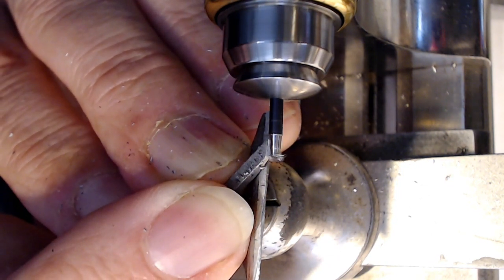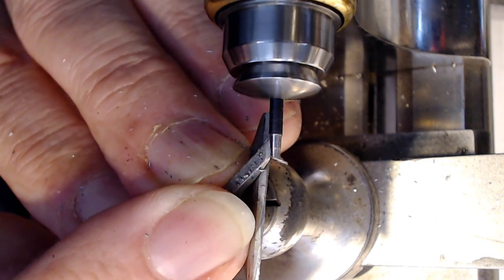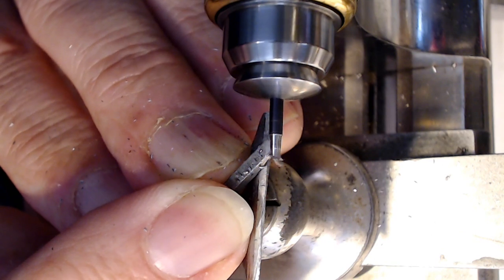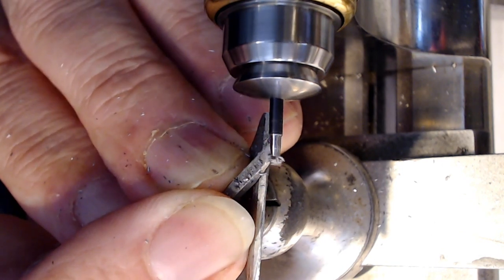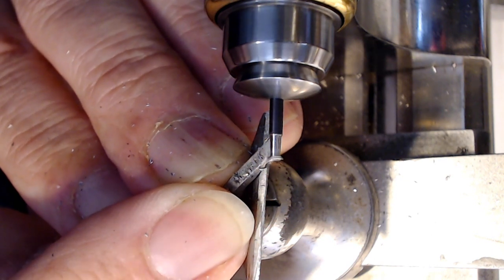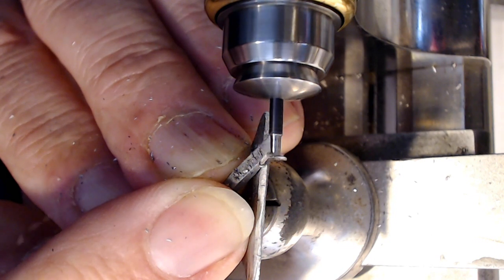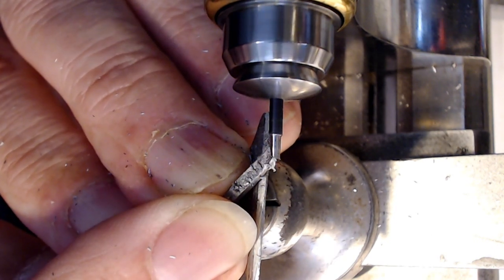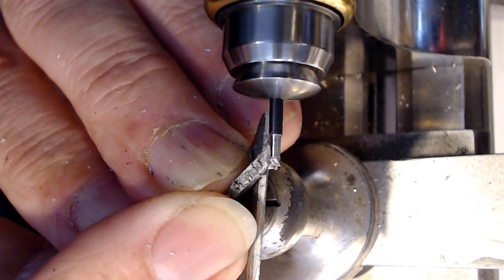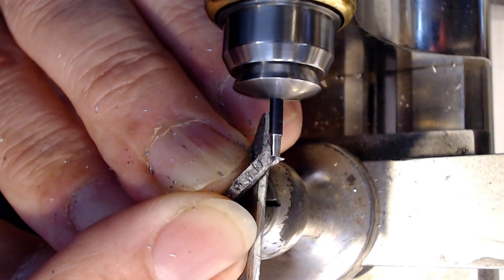And you just maintain that slope so that when you first start fitting your part on, it's friction fit. So you just don't want to cut it to the exact dimension, and then you've got to be working it up the shaft as you do this. I've made other videos on doing this, but I don't think I've had this kind of close up with these other videos. So I can chew a lot away here on the end.